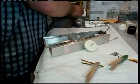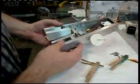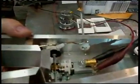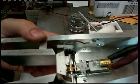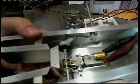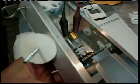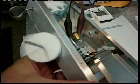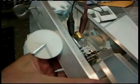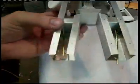Okay? Another little motor interlude. I'll run it on 3 volts. So maybe you can really see what's going on. See how every time that cam comes down, it pushes on the switch, beep, beep. And over here on this side, we've got 3 lobes. It could be flash, flash, flash, flash, flash, flash. See how all that stuff works.